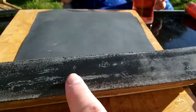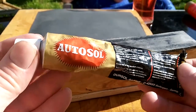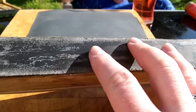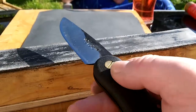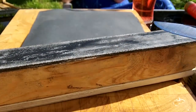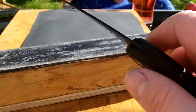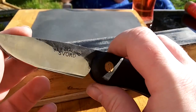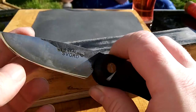To finish, use a piece of leather. Go to your auto factors and get Autosol or Peek — they're a metal polish. Rub that into the leather belt, stick it nap side up so the suede acts as a wick to hold the abrasive. Rub it in and leave it to dry in. Then lay the leather at the same angle you're sharpening at and do the same motion to polish up that edge. It's not like a steel that burnishes — this is actually a very, very fine abrasive, still cutting but only very slightly, and it'll put a finish on the final edge of any blade.